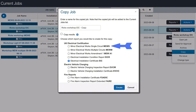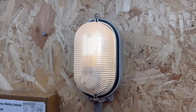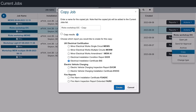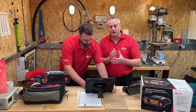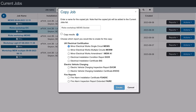There are a lot of choices — I can do an individual minor works certificate or multiple. So if this workshop needed an additional socket and a bulkhead, I could create two at the same time. Let's stick with simplicity and go with one certificate. Give it a new name — Rick's workshop, additional socket — and we're creating a minor works drawing on all the information we've done before. Each time you return to an installation using this software, you build up a catalogue of information to draw on.